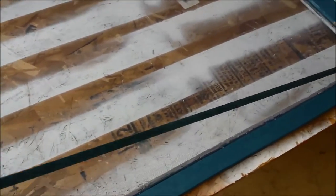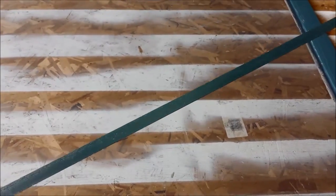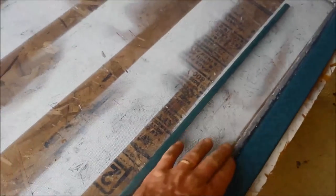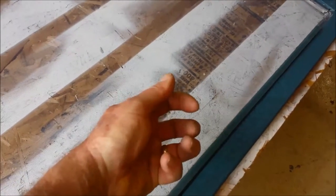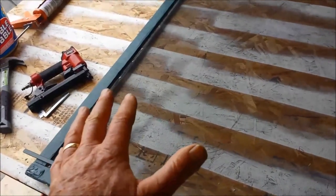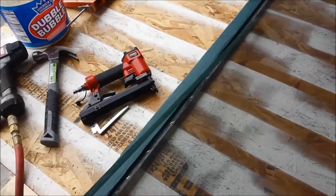I wanted to reiterate: the stop gets primed and painted on all sides before it goes in. And the reason you want to do this - I used a clear primer back here. This way, when water gets in - these are exterior screens - when water gets behind this gap, it's not going to fail and cause the paint to blister off. The way I'm doing this is going to last much, much longer than if a carpenter or screen person put all these together. They're not thinking in terms of the paint work, so what's called back-priming: you back prime all the surfaces before they get put together.